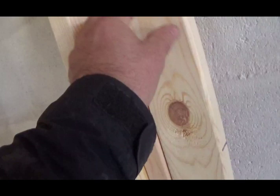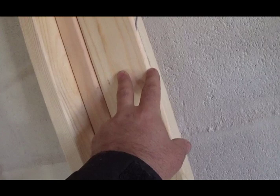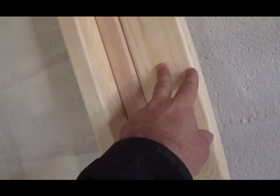If this were structural, there would be different framings. This particular one would be either three solids. This is my style of framing, probably prior to the year 2000. They have updated things, codes, so this might be the new standard. They've updated it; you'd have a solid stud pack in your corners.